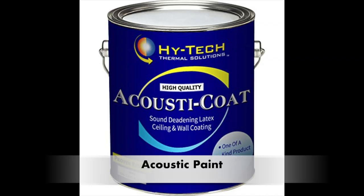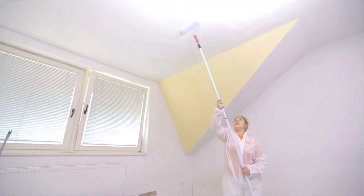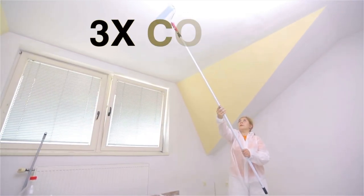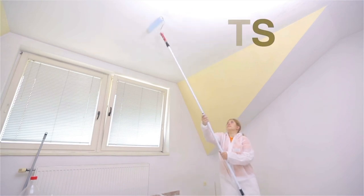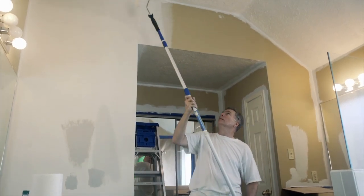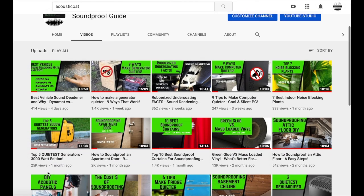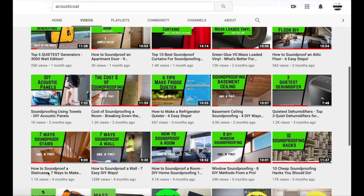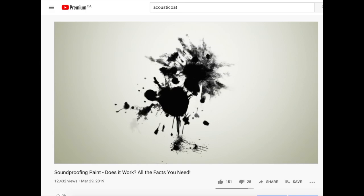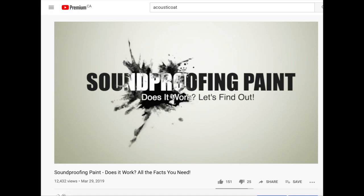Number five: acoustic paint. Using acoustic paint to help soundproof the ceiling will undoubtedly help drown out airborne noise, but will do very little to get rid of structure-borne noise. Make sure to apply at least three coats if you're looking to knock down a few more decibels coming from the room upstairs. Only applying one coat will do nothing when it comes to soundproofing. I'll leave a link in the description below to a video on my channel that talks about soundproofing paint and if it works — make sure to watch that video, as it might just be all you need to make that small difference.